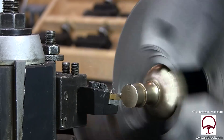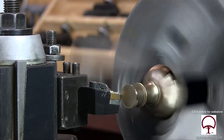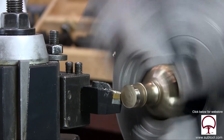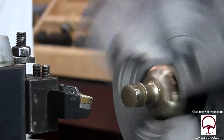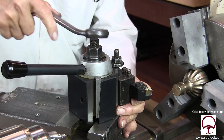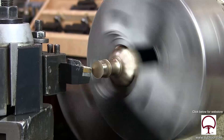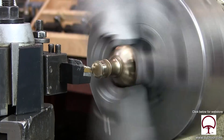I'm a little uncomfortable with the amount of cutting that I can take. So the first couple of cuts we're going to take, I'm taking it easy. We've got to bring the diameter down to size. I want to make sure that the cutting tool itself is on center. So I stopped there and I moved it a little bit to put it on center. Now we're taking another cut.